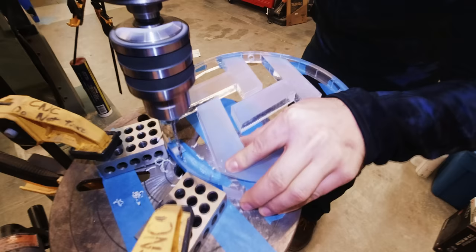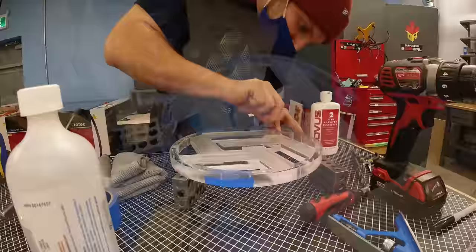Small holes in thick material are another thing that's pretty tricky with a laser, mostly because a laser beam isn't actually cylindrical but rather conical. And as you can imagine, a cone shape is not the ideal shape for a threaded hole. So instead of drilling all the way through, I just made little holes and then finished them afterwards on the drill press. That way they're on location and to the correct size.